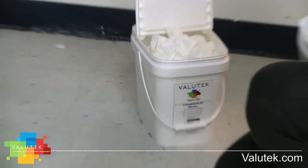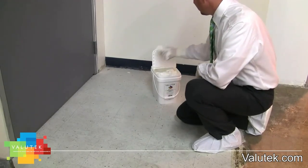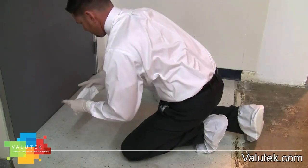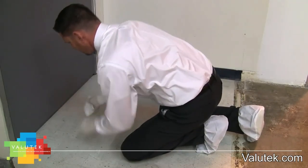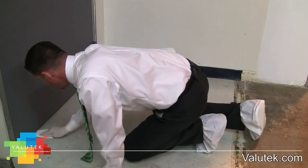The most important step in placing your clean room adhesive mat is floor prep. First, make sure that the surface is even and without cracks. If there is any surface irregularity, the mat will conform to that, and as we've already discussed, this causes delamination of the mat from the floor and leads to pockets under the mat where contaminants can harbor.